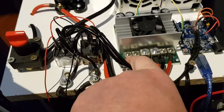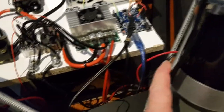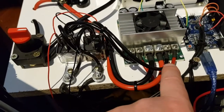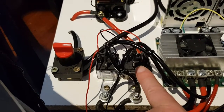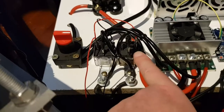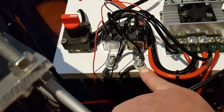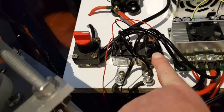Motor 2 and Motor 1 outputs: Motor 2 positive goes to this motor and Motor 1 positive goes directly to this motor. The negative of the Sabertooth 2x60 goes through a relay — a horn relay where the contacts are rated at 100 amps. Each motor has one of these relays. The relay output goes to this bolt and the negative of the motor comes and joins it, so in effect the relay forms a switch between the Sabertooth and the motor.